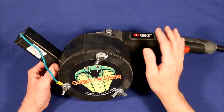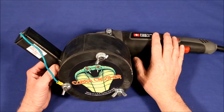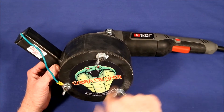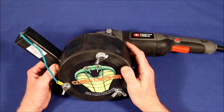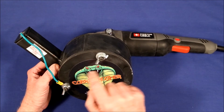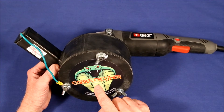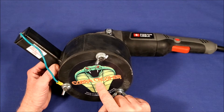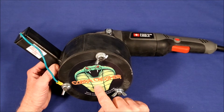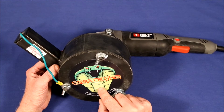One concern I had is that if some gold is in here — larger flakes — it's going to get shredded. I saw someone online who put gold in and ran it and the gold came out fine. However, what I've observed and read is that flakes of gold often get pounded and rolled up into small spheres, and I've seen this happen to about 50% of the gold. The negative is that because gold is so soft, a lot of dust gets pounded into it — it's contaminated and dirty. The little gold pellets come out looking dirty and are not as pure as when they went in.